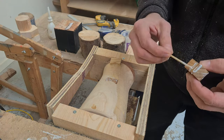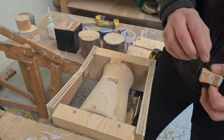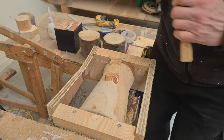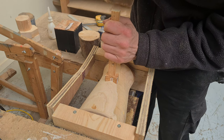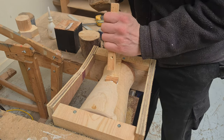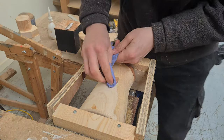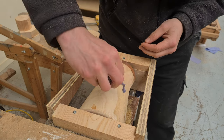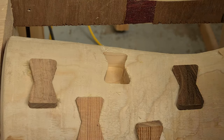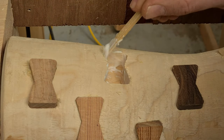I tried to be as liberal as I could with the glue — no point doing the base of the mortise, but certainly all around the sides, except for the bow ties going up near the top rim of the final vase, where only the other surfaces were glued. Then it's just a case of sighting up the bow ties and hammering them home. With the first butterfly joint placed, it suddenly seemed a very daunting task — there was a lot of area to cover to completely fill it with butterflies.